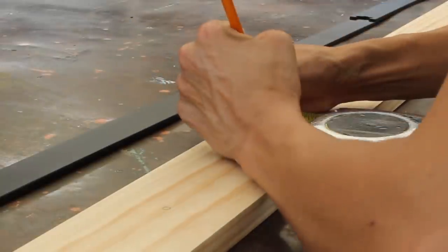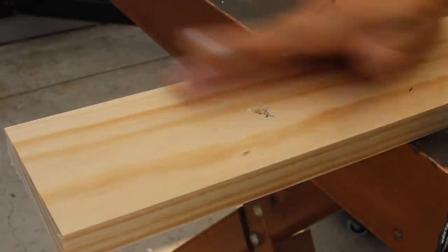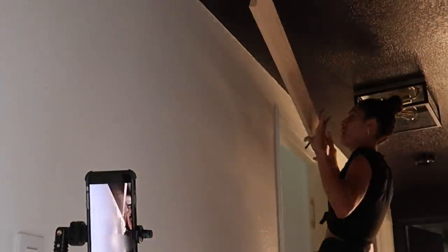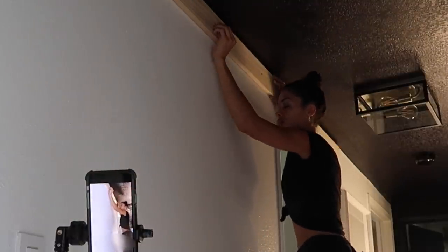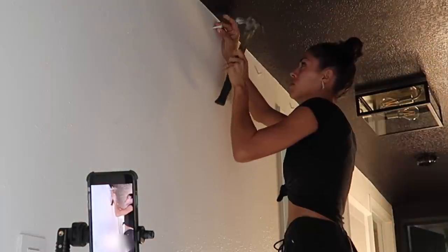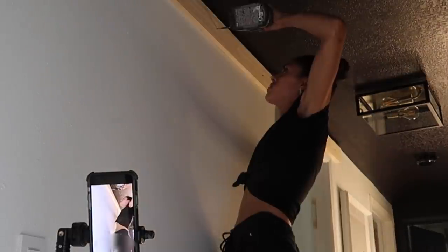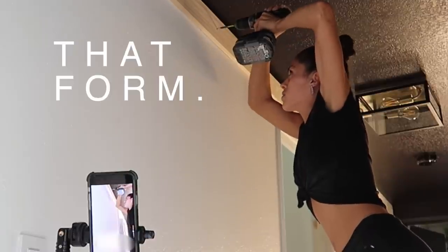I used that pine to be the wood behind the actual sliding hardware that will hold the entire door above ground so you can do the sliding. Make sure this piece of wood hanging behind the sliding hardware is a little bit longer than your hardware because that is the track for your door. I pre-drilled holes evenly throughout, then found the studs, marked and measured, and pre-drilled holes for anchors where needed. This is very important with a project like this because the door was not hollow - it's solid - so adding weight to it will pull down that track. Studs and anchors are absolutely key for a successful hanging sliding door.